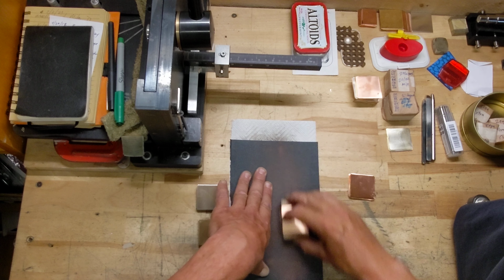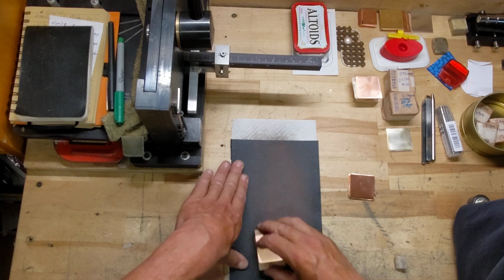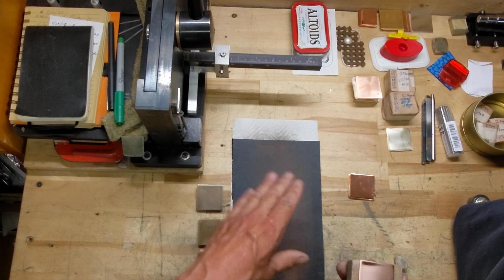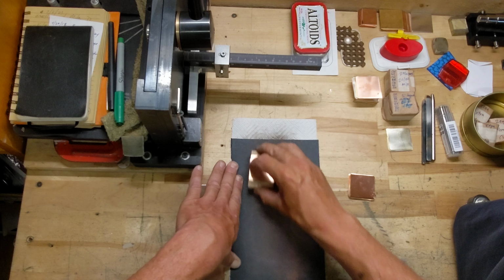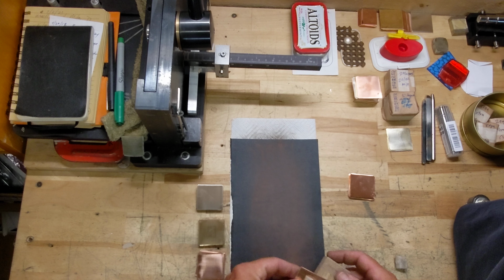If you do find a piece that has a really deep scratch or nick or pit, you can hold that piece aside and it can be on the outermost 2 layers. If you have more than 2 of those pieces, or if it just doesn't work in your stack order, then you'll just have to replace it.